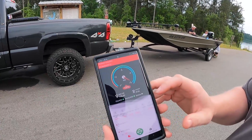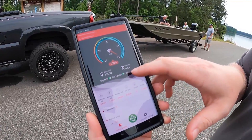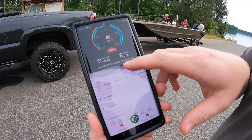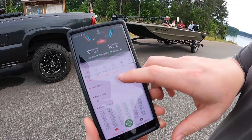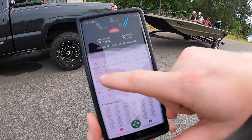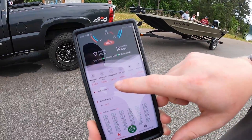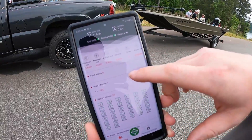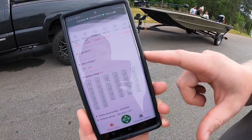The monitoring platform shows you full sum voltage, current amperage whether it's going in or out, whether the pack is able to be charged or discharged right now, and whether it's actually balancing. It also gives you the overall difference in voltages between the high and low cells, the maximum and minimum voltage of those cells in the grouping, the average across all groups, power going in and out, how many times it's been cycled, and then all of the individual voltages on every individual group of cells.